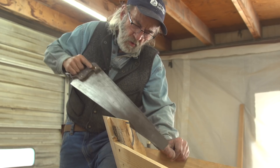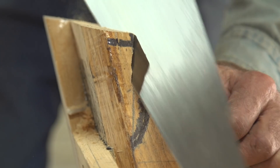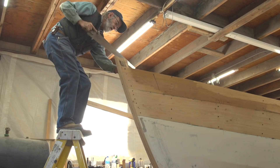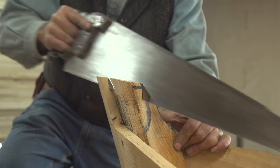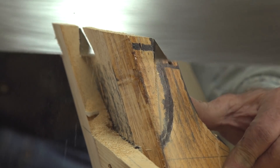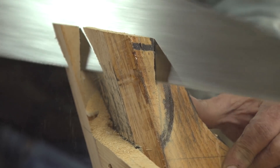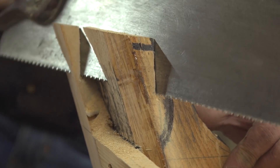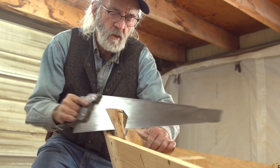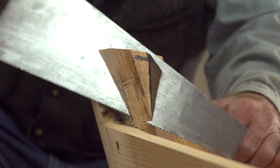I can really only make this cut with my hand saw because no matter what I tried to do with the electric plane I wasn't going to get in there properly. I didn't want to cut all of that off with the chainsaw because it's a little harder to control, but I'm actually going to use the chainsaw to sneak up on the line really carefully — that's not normally what you do with a chainsaw, but it's just like a sculpting tool. What I'm doing is trying to follow two lines: one across the top and one on the after side of the stem. I'll start a little bit slow to make sure I'm on both lines, because if we get off it's harder to get back. Laminates are hard to cut by hand and with anything else — with grain going in every direction, the hardest thing is to try to rabbit them, whether with an adze, a chisel, or otherwise.